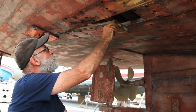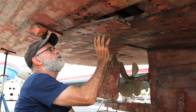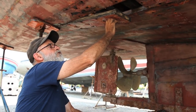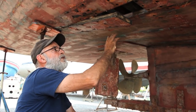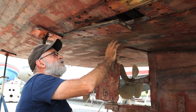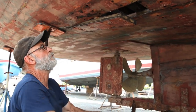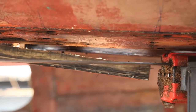Now I'm going to take a chainsaw and actually cut this to a scarf. This is the first boat I've ever done like this with a chainsaw. I've normally put two wedges along each side of the plank and used a skill saw operating like a milling machine — that's a different process. Most people would have done it with a router and various methods, but I found this method is much more effective, faster, and certainly more cost effective for the owner. I'm going to hold the chainsaw up in this manner and cut that right off.